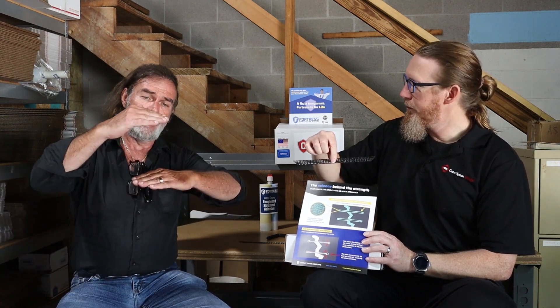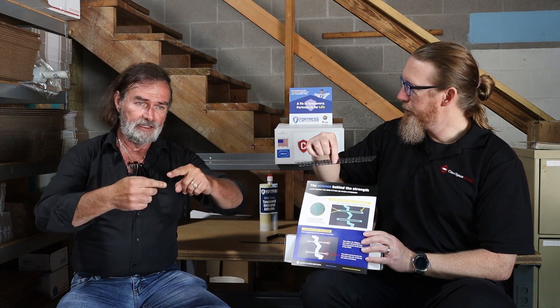Correct. And sinking it across the crack is what you're trying to say, which is what the carbon fiber is doing. It's non-corrosive and easy to install. All you need is a saw and a masonry blade — you go down about an inch into the concrete. If you want to put something over it, you may want to go a little deeper and sink it further down. The only time you'd go deeper is if you've got settlement and you want to get past the axis moment. For a crack simply opening and closing, a one-inch saw cut will do it.